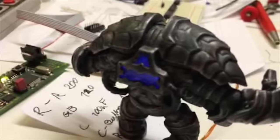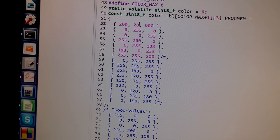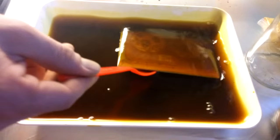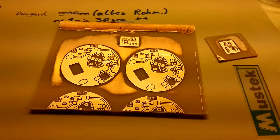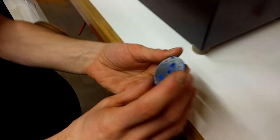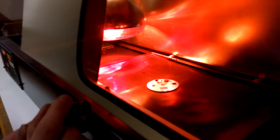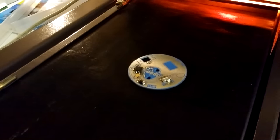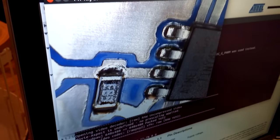So now it was time to actually make the circuit board. Turns out this is one of Artur's favorite occupations of all time — no wonder he's really good at it. He printed the design on transparent sheets, then we put them on a couple of photoreactive circuit boards and exposed them and developed them. There's really a lot of strange chemicals involved, and it was a lot of fun watching him do this. The finished board gets fitted with all the components, and then there's some soldering paste involved which activates at high temperatures, so it all has to go into this oven. Artur used a lot of SMD parts which are really tiny — almost too tiny to see with the naked eye. It was really amazing.